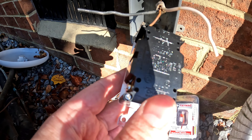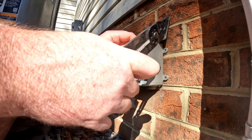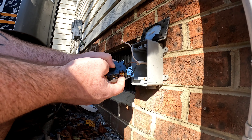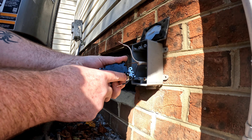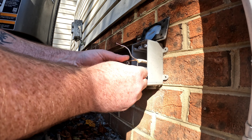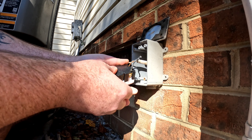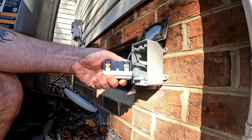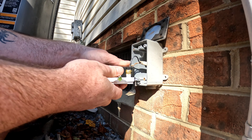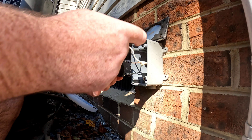It has a strip gauge for the depth — about the width of my thumb. I'll strip the ends of the wires and show you how they go in. Here's my hot on the gold side. The screw has to be backed out so the terminal hole is clear for the wire to go all the way in. I shove it all the way in — it's not a traditional auto-locking backstab, so I then tighten the screw, which compresses the clamp inside and secures the wire tight.